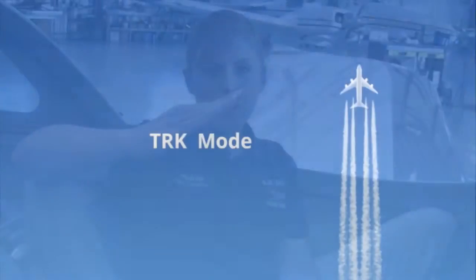Likewise, when the autopilot is engaged and aircraft airspeed drops below the minimum, the autopilot enters an airspeed hold mode, pitching the aircraft down to prevent dropping below the minimum airspeed. When the aircraft's altitude drops below the target altitude bug and the autopilot cannot pitch the aircraft up without going below the minimum airspeed, the EFIS presents the prompt: Min Airspeed, Add Power.